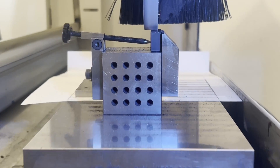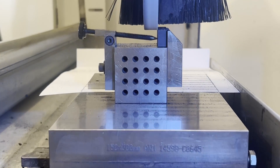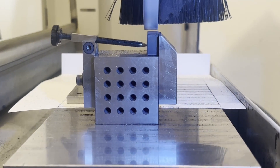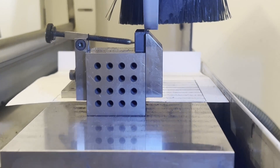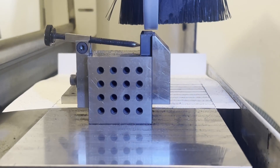The fixture I'm holding the part in is what we call a second-dimension fixture — we use it for squaring very small parts. It's just a toolmaker's cube with a rib and a small cone-tip screw pushing the part against the rib. Insanely versatile, and I highly recommend making yourself one if you're into grinding.